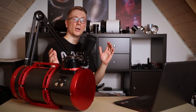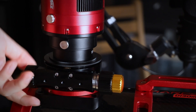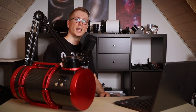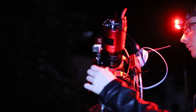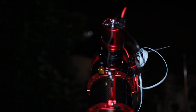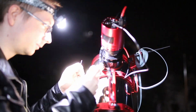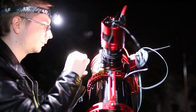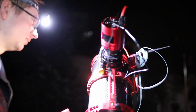And what do you know — the autofocusing worked fine. When you find a problem in your process, the best tactic is usually to tweak one thing at a time and then test it again. In my case I lubricated the gears, changed the step size, and introduced 40 steps of backlash compensation. I can't be certain which change solved the issue, but I am quite confident it was the backlash setting, because the error always happened when the motor was reversing direction.